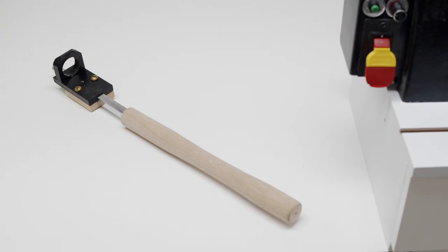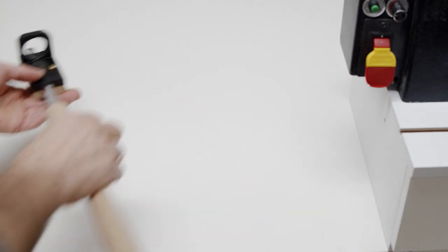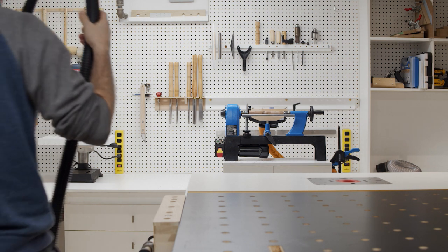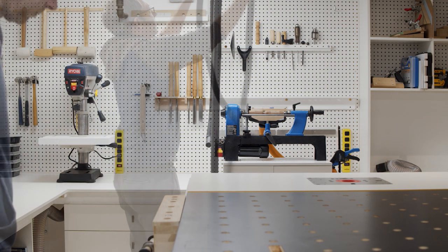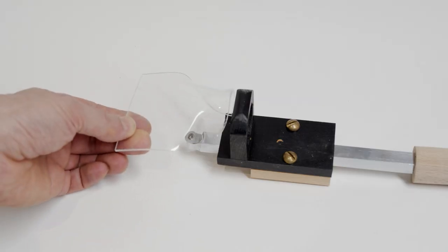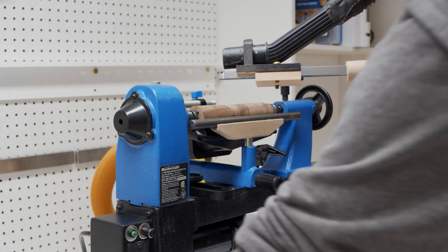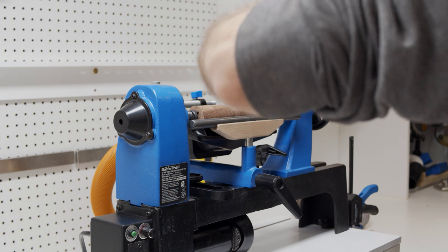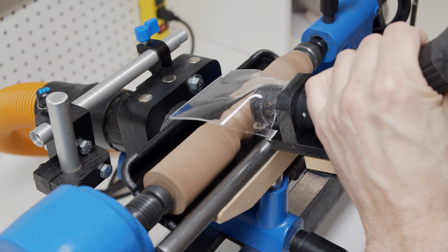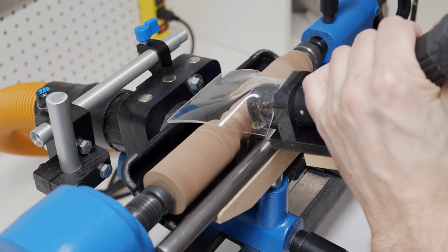I remembered one of my previous attempts: a hose attached directly to the head of a carbide turning tool. Now this was unsuccessful by itself, but how would it work paired with a floor sweep? I added a second vacuum to attack the tool head directly. I also took some clear acrylic, bent it with a heat gun, and created a micro chip deflector for the hose. With the floor sweep scooping up the chips orbiting the spindle and the second hose capturing chips right at the point of cutting, I couldn't discern any uncaptured chips.